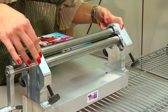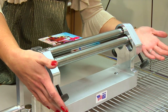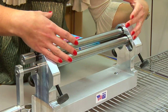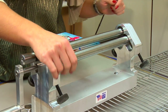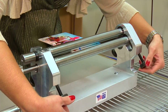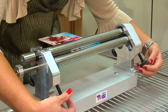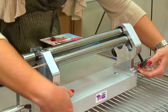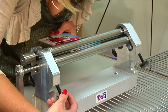Now I'm moving to the front part of my precision roller. You'll notice, again, we have two knobs. This one you can really play around with, especially for metal art — I've seen a lot of really cool things sent in by our customers. You can adjust it equally and create a really nice curve, whether you make it nice and tight for a very curvy result, or just a very slow curve with barely any bend so it stands. One little tip: as far as the pin itself goes, you can tighten it all the way if you want to create the same look each time. If you know you're going to do full rotations — say three rotations — that will give you a consistent curve so you can replicate the same image each and every time.